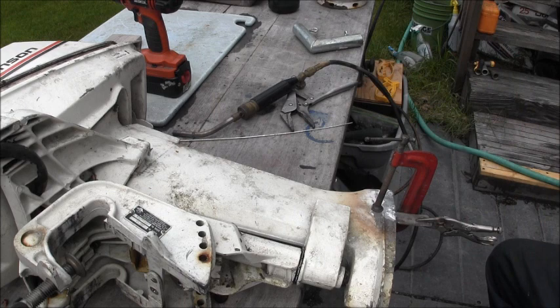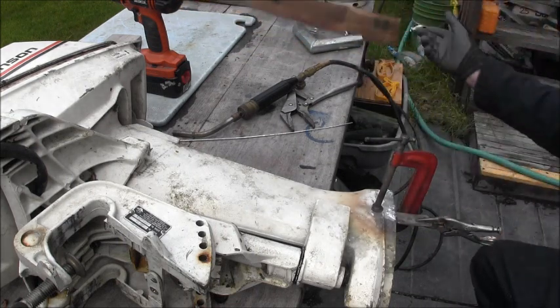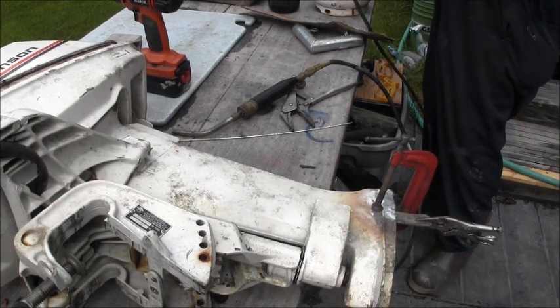I'm sorry I don't have the number on these, but I'll get it for you. If you notice on here I wrote new generation aluminum rods. This stuff's come a long way, actually. I tried the earlier ones and they just didn't go on well. But this new stuff, and I'll get you the number, it works pretty good, actually. You can fill in some pretty big dings with it, and I've welded transom clamps. I've even used it on heads and it works pretty good.